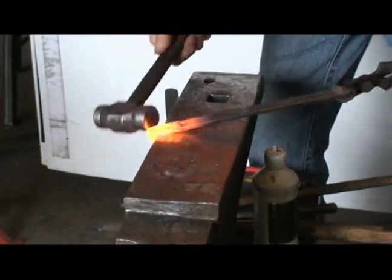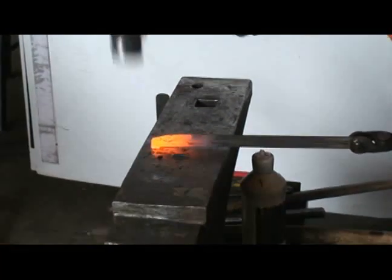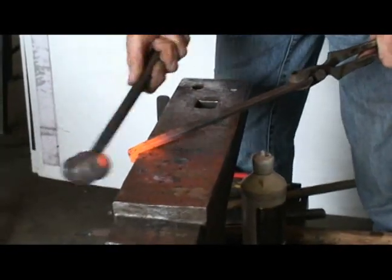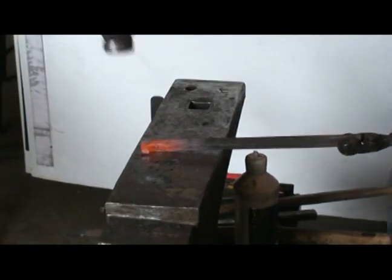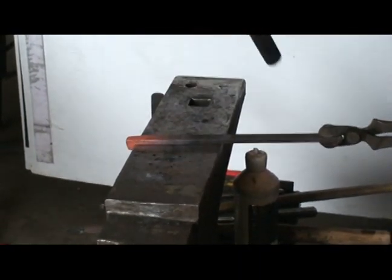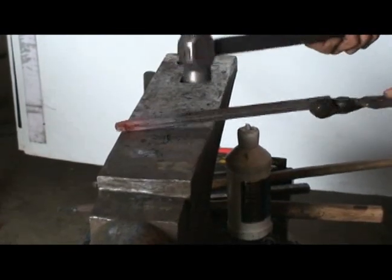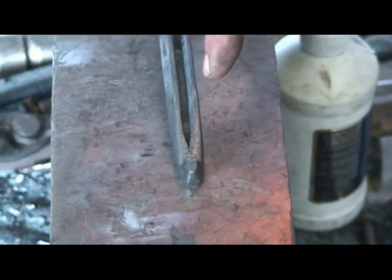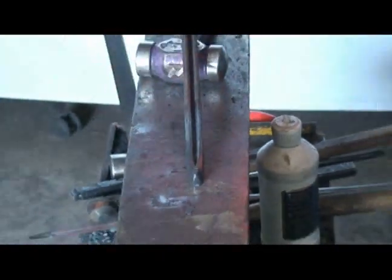I've got plenty of material to forge down. I'm picking up and just kind of getting a lot of the rasping work out of the way. Now you can see I've got it kind of blobby, so I'm just going to clean up my section right to the heel — just kind of overlap and flow and bring that all together. I've got plenty of heat. I'm going to rasp up the edges. We've got the wedge tightening up from the medial heel on in, and it's leading slightly inward towards the inside aspect of the bar stop just to be safe — keep them from brushing.